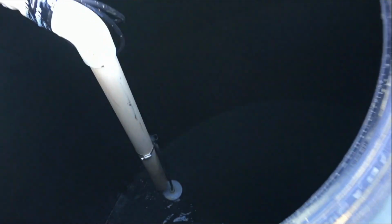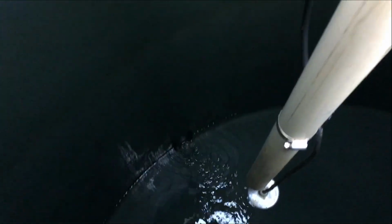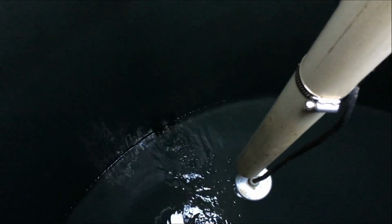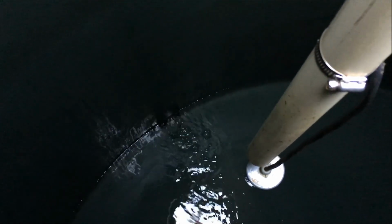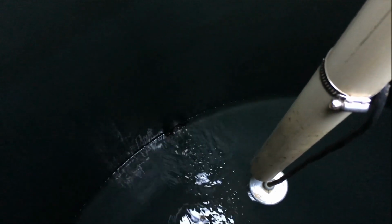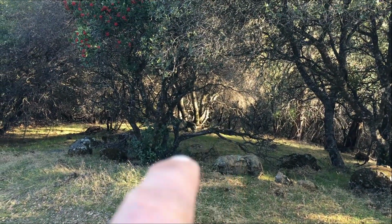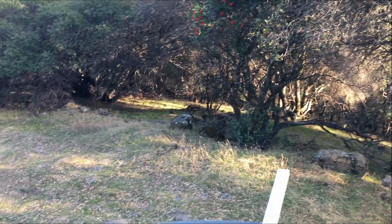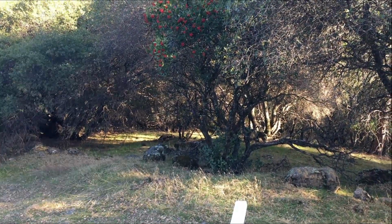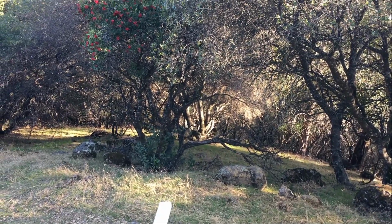All right. Okay, hopefully you guys can see this, because that's impressive. That's the water coming through a 2-inch pipe with pretty good flow. That's only with one pump on. That's about half that pipe of volume of water coming through, filling up. And that's the well we were just at, way down there, probably about 200 feet. And the well is about 220 feet, so about 400. And the pump is rated to go up 700 feet.